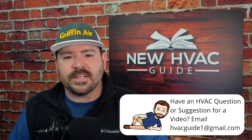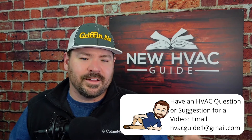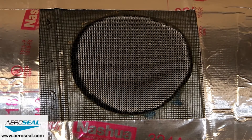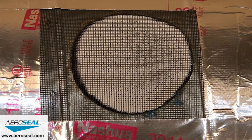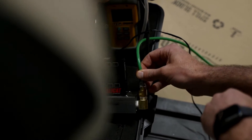If you are going to reuse ductwork — you've had it inspected, it looked good visually, it passed the sniff test, and it was sized correctly — I would recommend looking into a company called AeroSeal. They have a really cool product where they can seal that ductwork using a system that first tests how leaky it is with pressure tests, then does the treatment to seal all those holes and make the ductwork more efficient. A lot of folks don't realize that leaky ductwork is one of the biggest energy wasters in your home. After their process they re-test the ductwork to confirm it's good and sealed up.